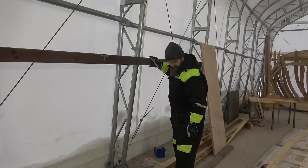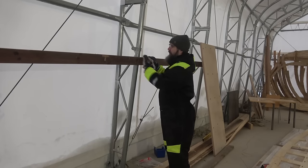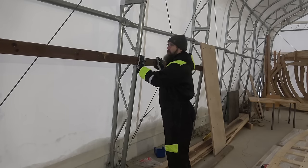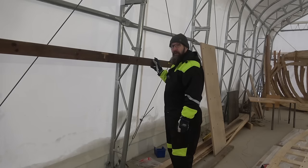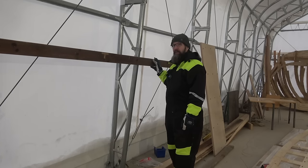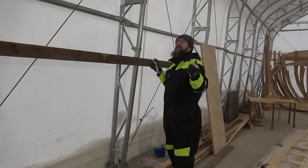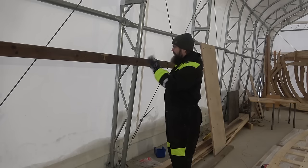And then we're gonna get the insulation and roll it right here and put another board on top to every joint and screw them to this other board. So there will be two boards and the insulation between. And that way we should get a pretty airtight solution for this that doesn't weigh a lot, because the construction of this shed isn't really designed to handle additional weight that much, but this shouldn't be that heavy. So that's the idea.